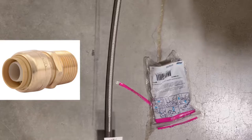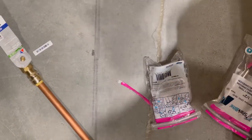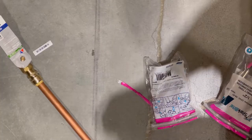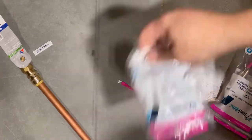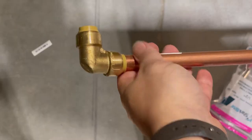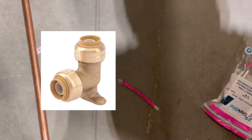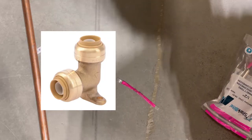Now I'm threading in a half-inch SharkBite male adapter — one end threads into the ball valve, the other end we're going to push in some copper pipe. I chose copper for the aesthetic as well as the rigidity, and I chose SharkBites because they require no specialty tools to install and when I'm done I can put these parts back. You can see how easy these things snap in — no soldering or specialty tools required. At the top of our structure I put a half-inch SharkBite drop ear elbow, another length of pipe, and then a half-inch by male thread elbow.